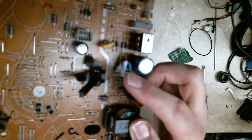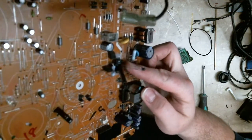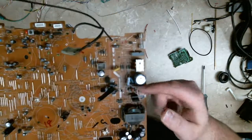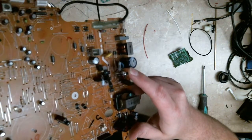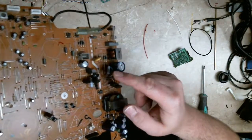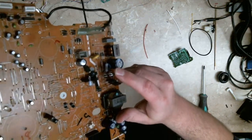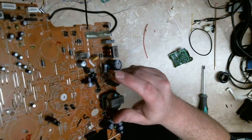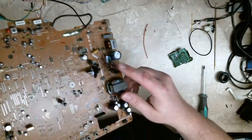It has two pins. So you're probably saying, well, why doesn't it have three? Well, look at this. You probably can't see that so well, but there's a lens on the transistor. Why would a transistor need a lens? Well, one of these is collector and one is emitter, but the gate. Remember what I was saying about diodes over here? That when photons hit the diode junction, they generate a voltage? Well, the transistor's two diode junctions together. So they have a lens focusing light onto the gate, right? So when photons hit the gate of the transistor, they create electrons, or free up electrons anyway, in the doping material.